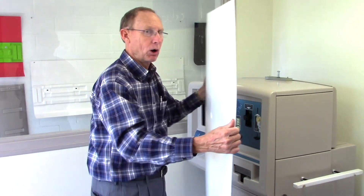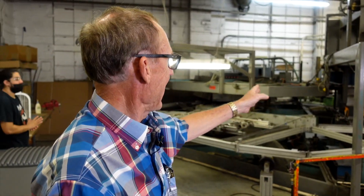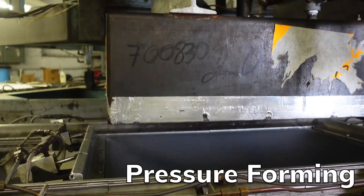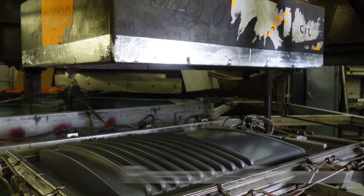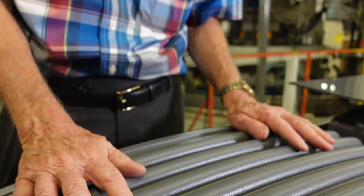This is a perfect replacement for fiberglass, and we can prototype for you. We can build a production tool right in-house. Pressure forming is the science of adding 120 pounds of compressed air to force this smooth material into the tool to pick up this pressure and this texture. Any texture that you could use on an injection mold you could have on this pressure form part.